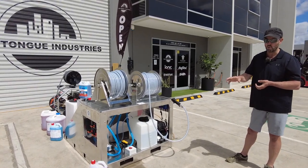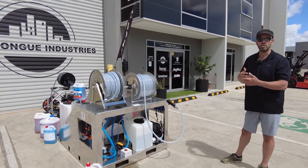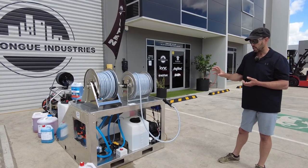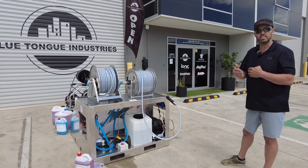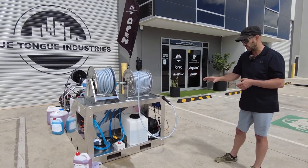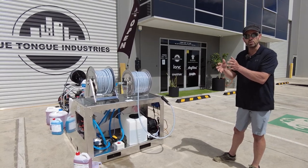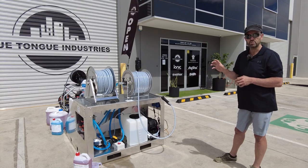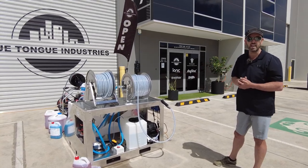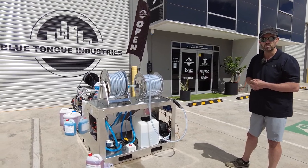We'll fill the soap container with our house wash mix: 18 litres of water and 1.5 litres of our house wash purpose-designed soap surfactant to help release dirt in a general house washing and building wash down configuration. We're then going to add some Sticky Blue to that 25 litre soap container — not a necessary add, but it gives more cling on vertical surfaces. We'll test 500 mls and a maximum of 1 litre. Other chemicals about to hit the market include our True Blue, a commercial non-caustic heavy-duty degreaser.